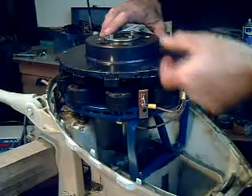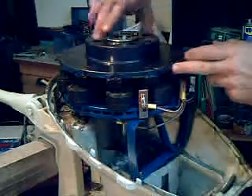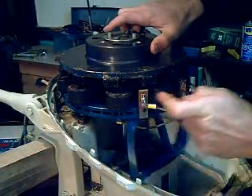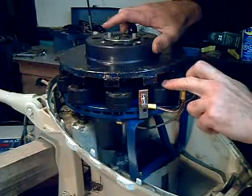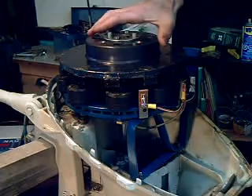And a hub that's been turned to fit the bearing races. On the rotor are 12 supermagnets, on the stator are 9 electromagnets, and these coils are made with cores of common nail gun finishing nails that can be bought in a hardware store.